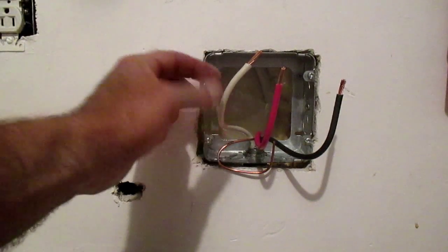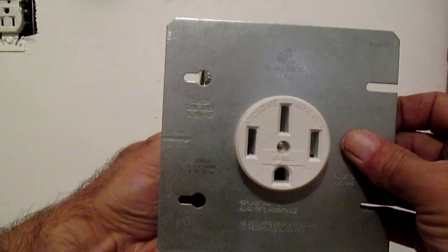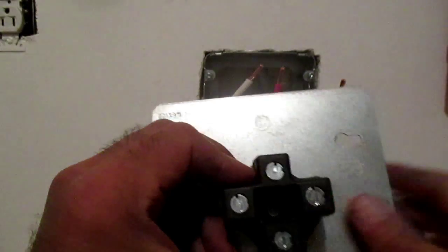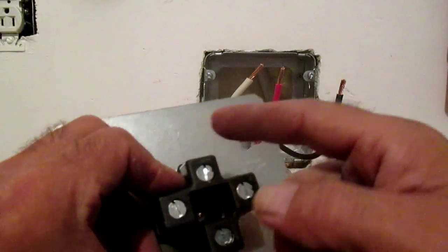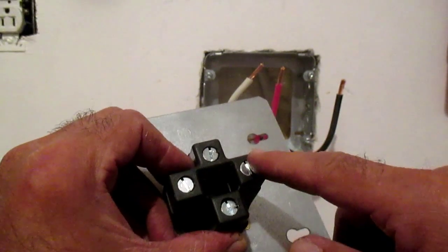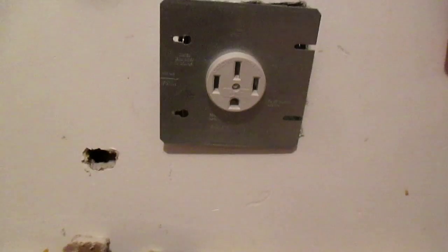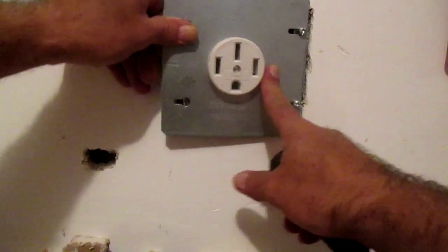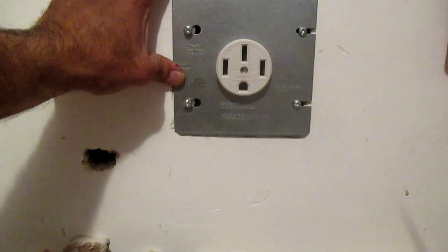Once the electrical box is securely mounted in the wall, cut back your wires enough to go into the connectors for your outlet. On the back it's going to be marked — look closely, you'll see it's marked white there and ground there. So obviously our white wire is going to go in where it's marked white, and then we have our two hot wires into these two. Once all your wires are connected and everything is good and secure, we're going to move this into place, slide our panel into place, and then tighten these down.